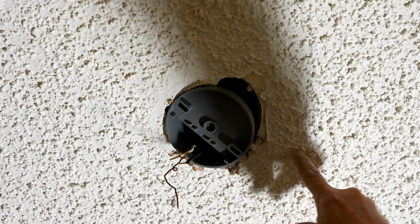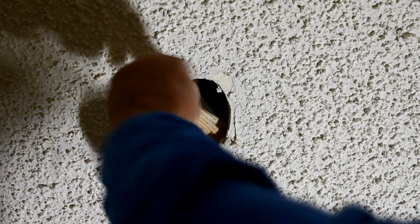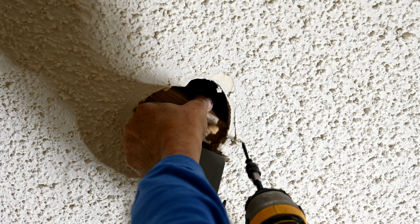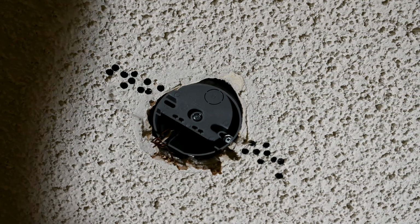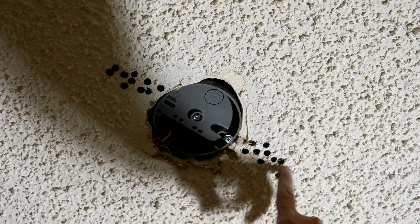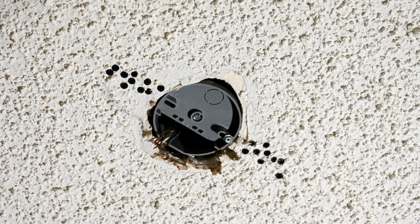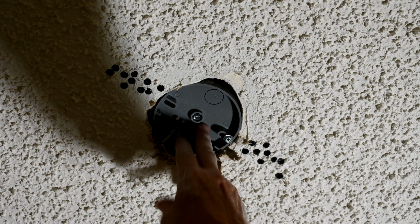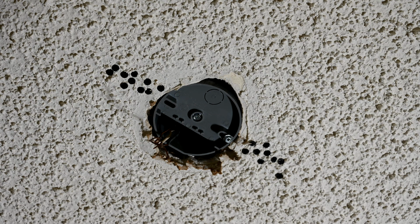And then we're going to add our screws right here to secure to the bottom of it. So what I do is I just grab the 2x4 here, hold on to it snugly, and I'll run a screw up into it. Okay, so you can see up here we've gone out several inches in either direction with drywall screws. So the stud is running across here now, and it's perfectly in great shape there. It's rock solid.